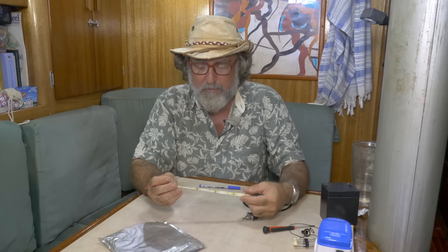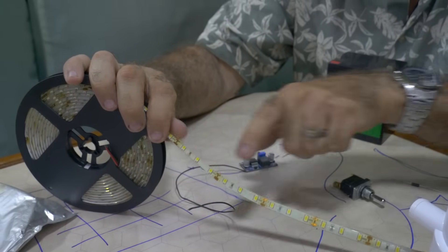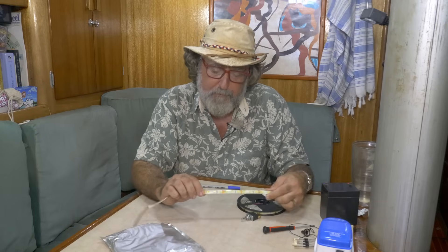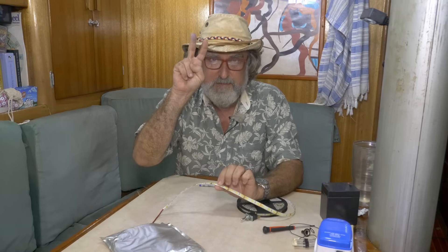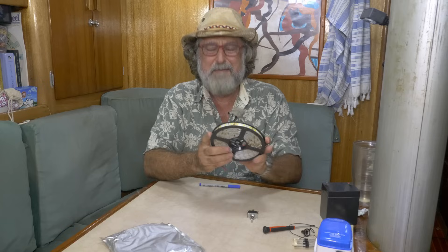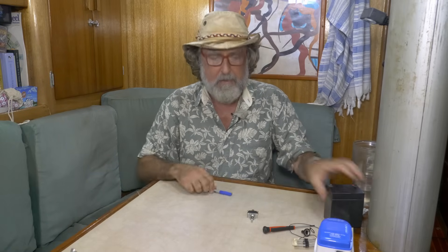You don't need to use the whole roll — that would be overkill. You can cut them at the cut lines, scrape back the waterproofing, and solder right onto the copper. They're pretty waterproof, though not perfect, so I'd silicone the heck out of it when installing. As for the solar panel, I looked on Amazon and they still have 10-watt panels — that turned out to be way more power than I need. A 5-watt panel would be fine.